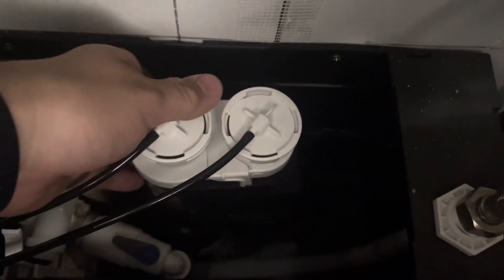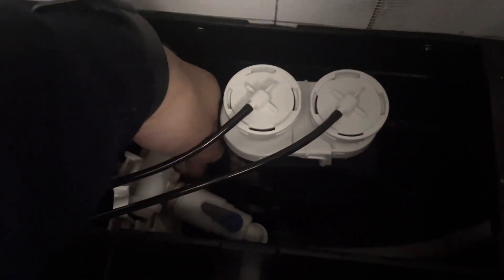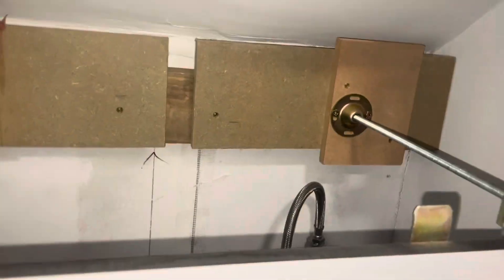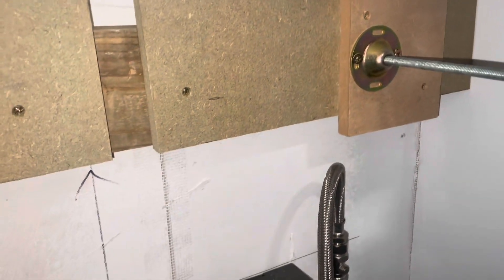What we're going to do is get rid of all the water by flushing the toilet. As you can see, there's quite a lot of limescale on this system. First of all, we're going to isolate the system by turning off the isolation switch, then we can remove it all and check inside to see what's going on — see if it needs a new washer or if there's something else causing it. Grab yourself a flat blade screwdriver and turn off the isolation valve. There's also one inside the tank, but luckily for me there's one on the outside for this job.